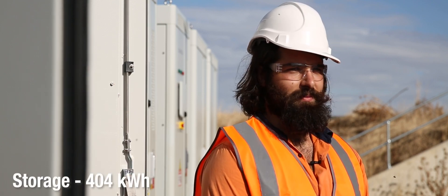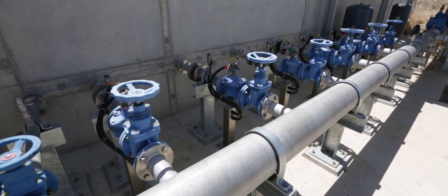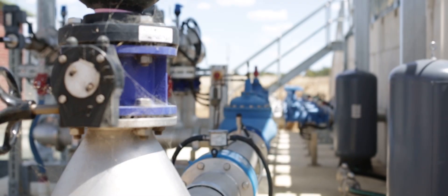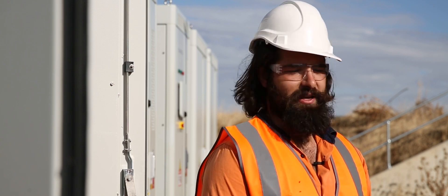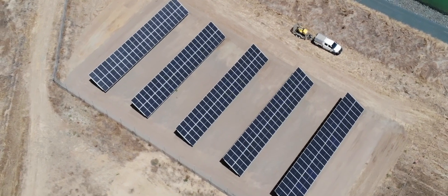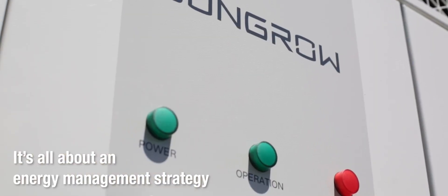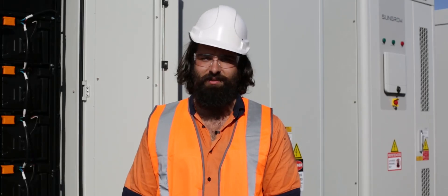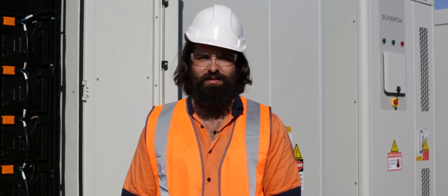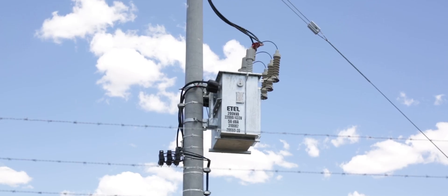The battery storage on this site has been designed to kick in when the sun is not on, or if the load at the pump station is very high, which has been predicted to happen in the next few years. It'll be a combined 200 kilowatt output between the PV and the batteries. The design is for the solar to provide as much power as possible to the pump station first, then the batteries kick in to cover whatever the solar isn't providing, and also to operate at night using stored energy to run the pump station and minimize the draw from the grid.